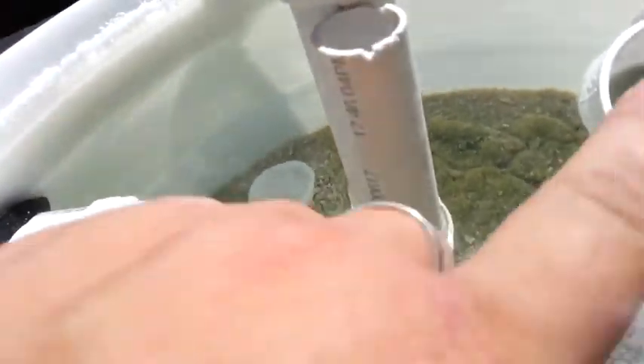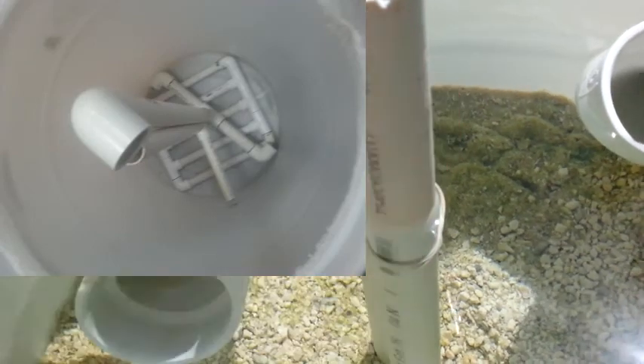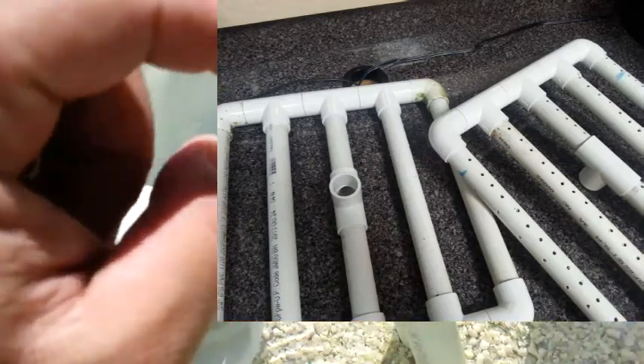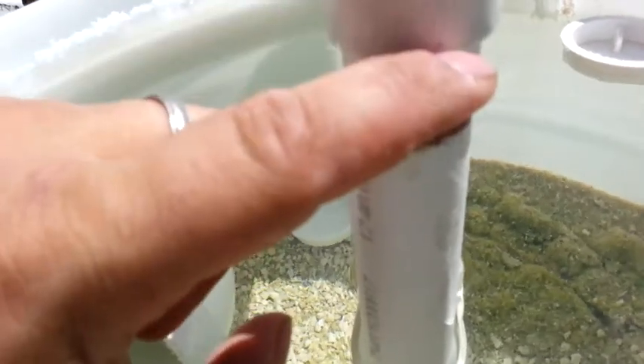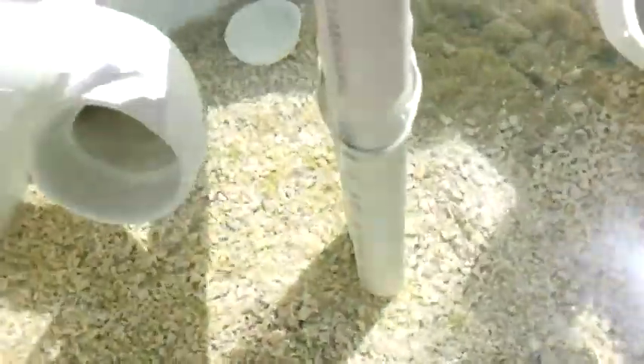This goes down and I created a shelf out of PVC pipes that has a bunch of holes in it. Whenever I go to do maintenance on this filter, I put in a blower — like a shop vac or whatever — just hook it up to this, turn it on, and it blows air up through the bottom. I've got that piped in together, figured I might as well utilize what I already had.